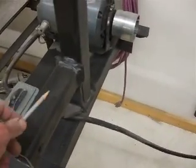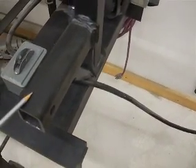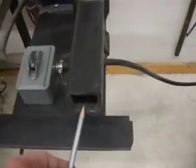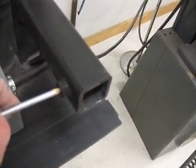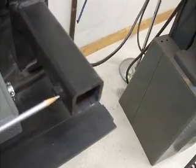This part here is a piece of two-inch square tubing, two-inch square, six inches long, and a quarter-inch wall. This little bolt hole is where the hitch pin used to go through. I went ahead and welded a half-inch nut on there, and then there's a pinch bolt that holds all the little pieces in place. That's about an inch back.